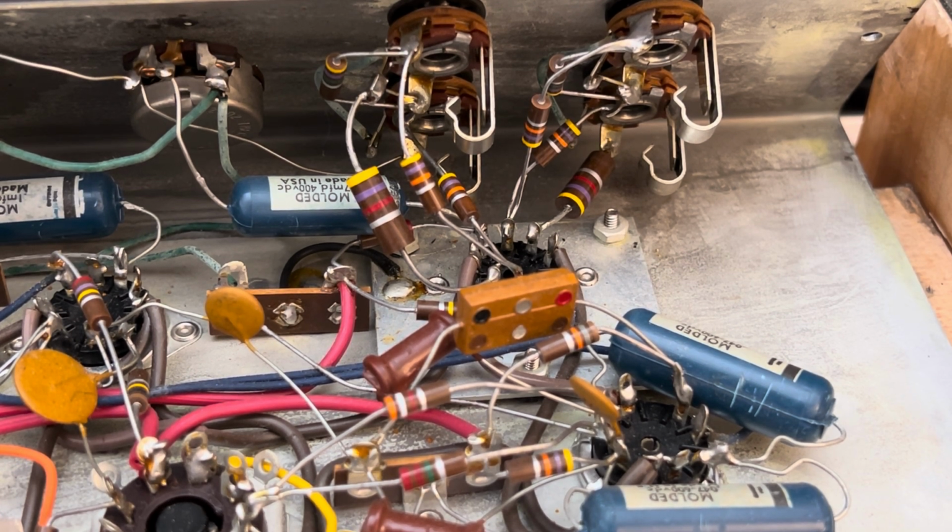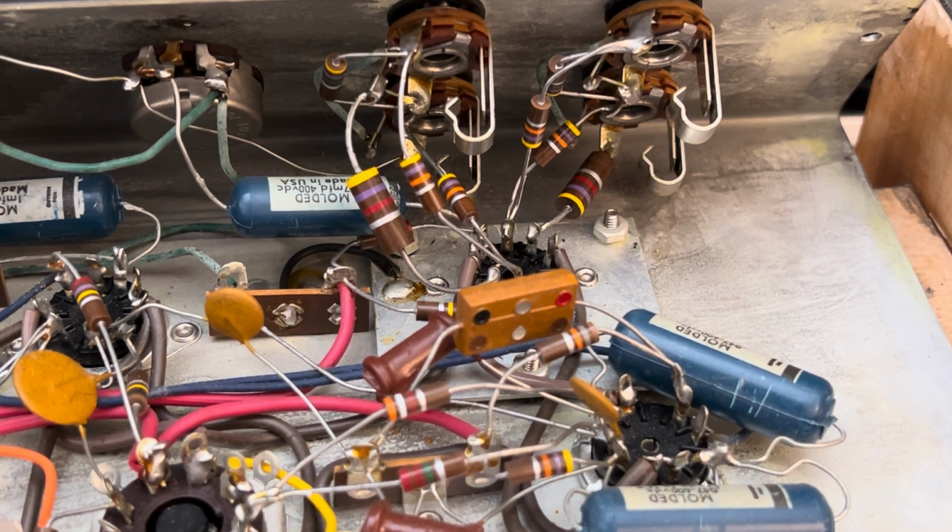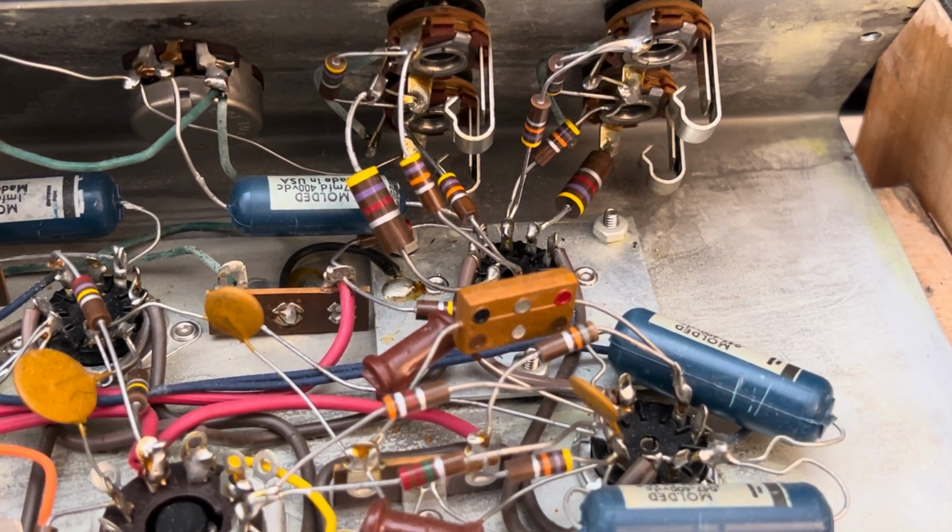I'm going to go through the tube sockets. I don't even need to clean the pots on this. Just the jacks needed the most attention. But I'm going to flip her over and knock out the tube sockets and see if they even need to be retensioned. I doubt it's the original complement of tubes. So sadly, there's not much to report, but that's a good thing.